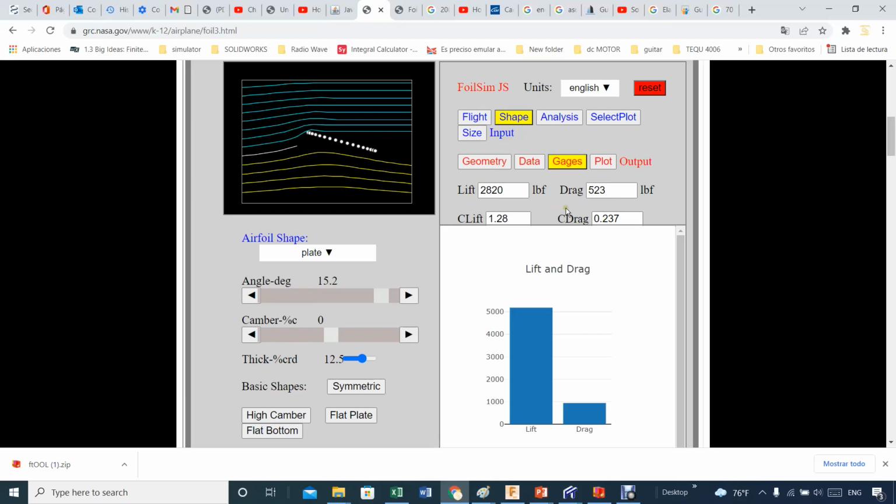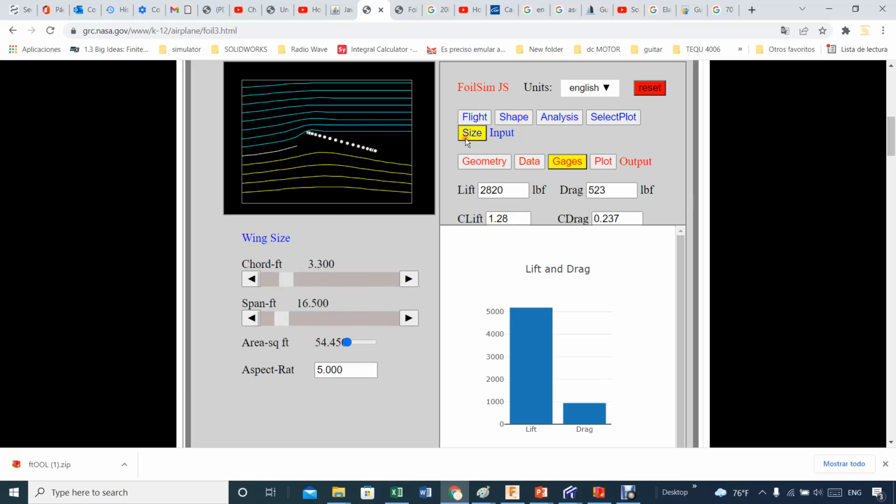So you can really start to generate your own data of where your plate is with respect to the angle, and what the forces are based only on the coefficient of lift and coefficient of drag, but very important also, it is based on the actual area of your solar panel. You can punch in your solar panel area, and you come out with your calculation. Let's see, anything else here that is important? I think that we are in good shape.